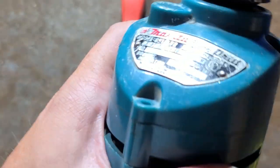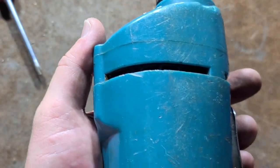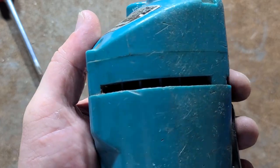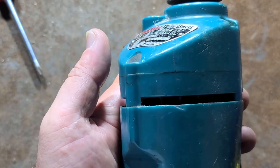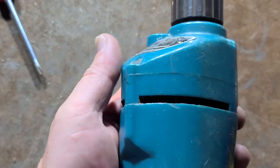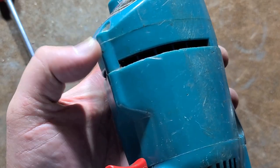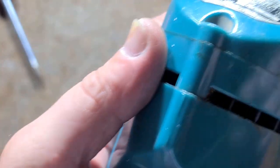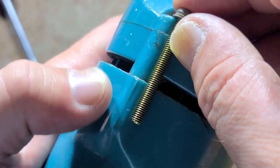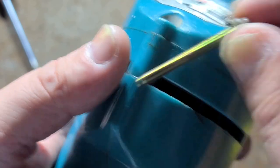Got it back together. One thing I've noticed on these old Makita tools is cracking happening a lot — just because the polycarbonate, even though it's fiberglass reinforced, is a hard, tough plastic, but it's also brittle and really prone to cracking. Much more prone than nylon, which has a little more resiliency. Interestingly, this crack is only in the front part — just in this diaphragm portion, so it must have been strain or something that caused it.